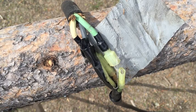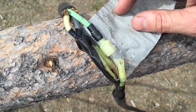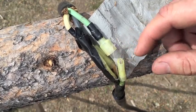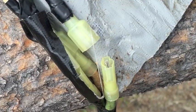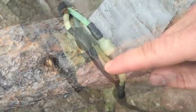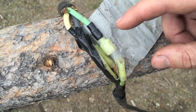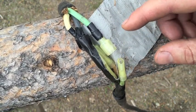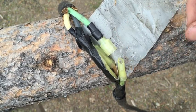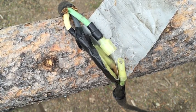So I was unwinding the electrical wire and I pulled off this duct tape to see what it was like in the connectors, and I found this one loose - well, disconnected. So I'm embarrassed to say the reason why the wind turbine wasn't doing anything was this wire was disconnected. So I'll have to connect it back together, put some proper electrician tape over it, and then rig it in a way that there's no strain on it so it doesn't pull apart in the future. I couldn't have figured it out unless I took it down. But anyway, we'll go from there.